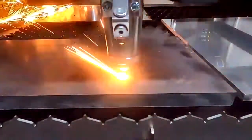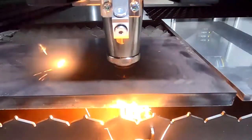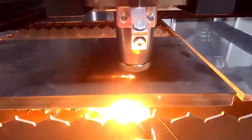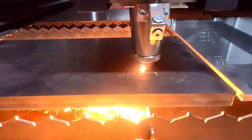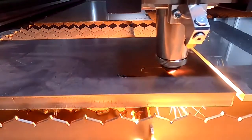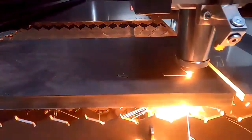20 millimeters. The most important thing is, of course, the piercing — that looks quite good. And now while cutting, we can see that the cut is really beautiful. We are cutting here at 900 millimeters per minute and we are using about 0.7 bar to cut these parts. We will have a look at the part at the end of this session.